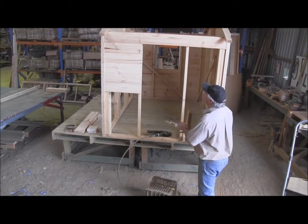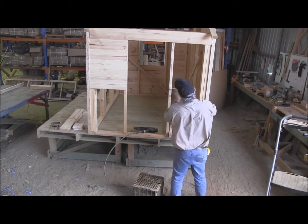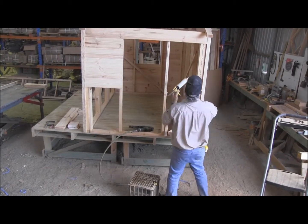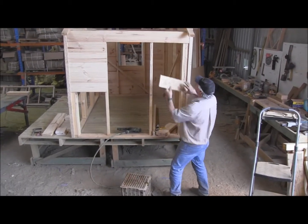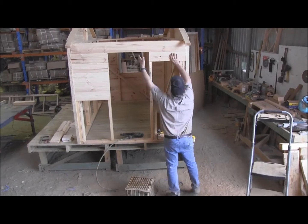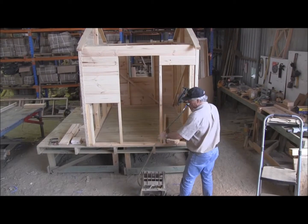Same deal with this side. Come down with the five boards, ready for the window. Nice bead of glue — if you can get a little bit of glue right in the corner, when you put the board on it'll actually seal it, seal the edge of the piece of cladding off, which makes it nice and waterproof.